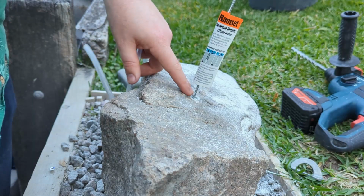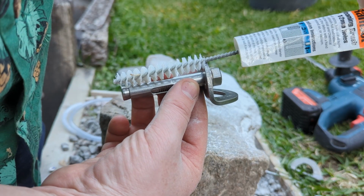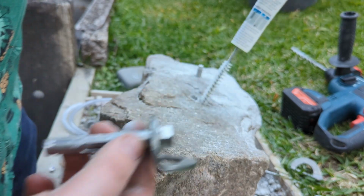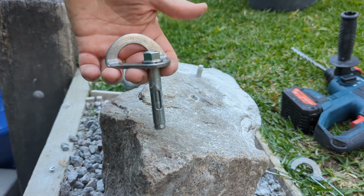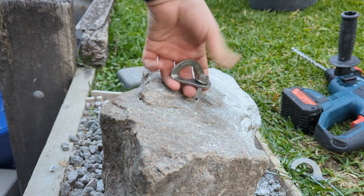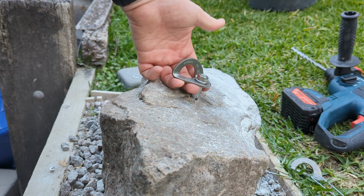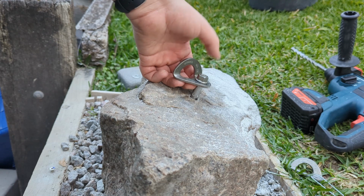Okay, so that's a handy measurement too. If you measure out your bolt versus your brush, you can make sure that you've actually drilled deep enough when that goes in there. So this style of bolt will usually go in much easier than the wedge bolt. But then they'll also come out easier as well. So if you're bolting on lead, that might help you because you can get them in quicker.